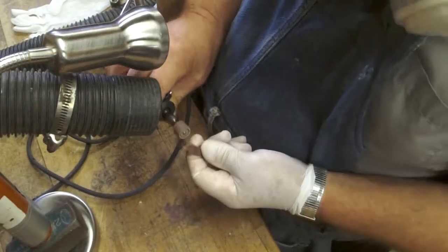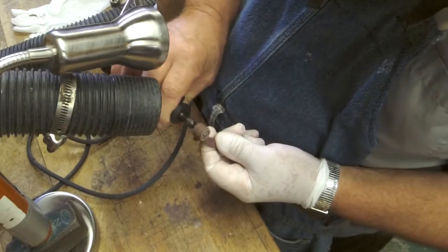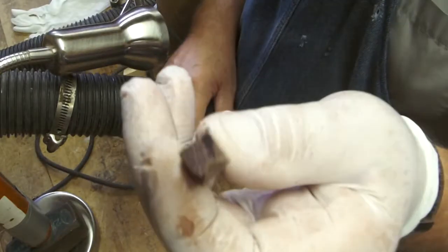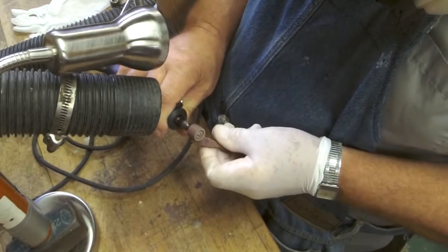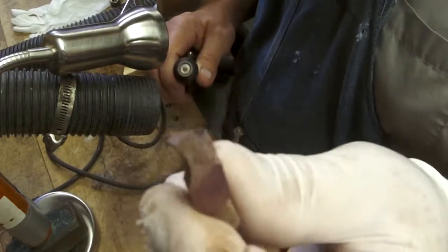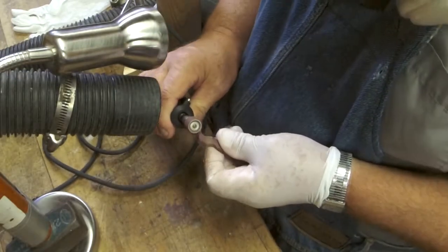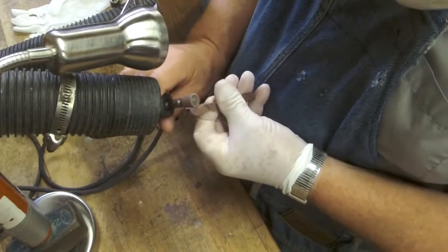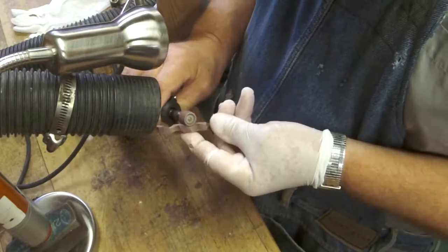There we come. Repetition. That's the key. Go slow and repeat. There you can see it sort of coming in now. The point of the wand. See, it's coming up. Stay on the flat sides. Notice how I haven't turned any of the edges of that blank piece of wood yet. Everything I'm doing is still keeping the wood rectangular.